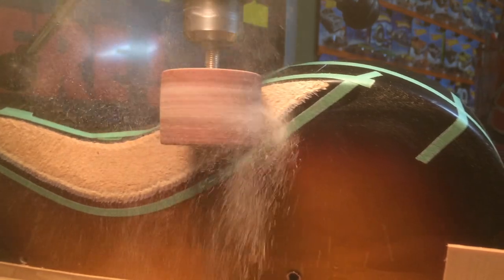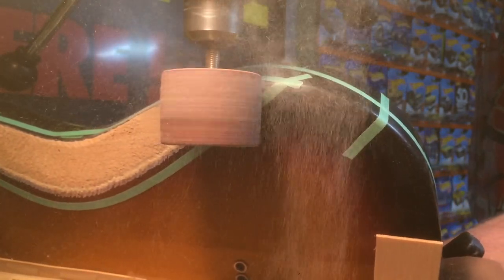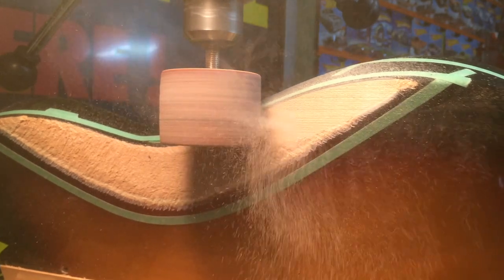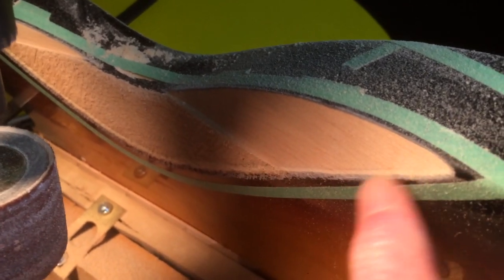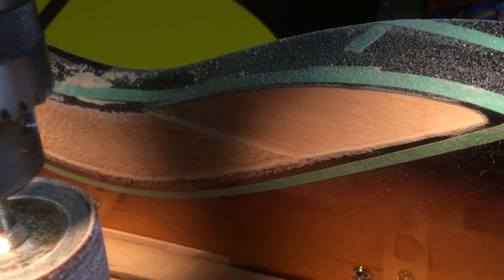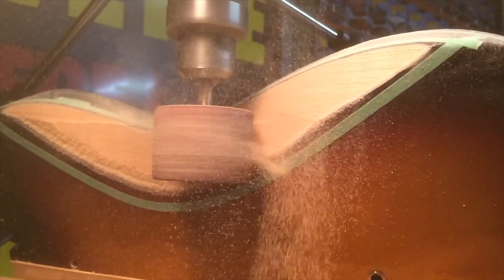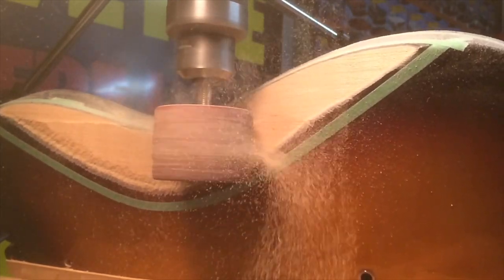You can see how the jig works — it's set up in the drill press at a fixed angle, so the barrel sander comes up really straight. I drag the body back and forth on the table, watching my line to keep it straight. I only have a shorter barrel sander right now, so I need to move the table up and down a bit more. I start at the top and work in sections. It might seem like a lot of work, but take your time — the more patience you have, the better it'll turn out.